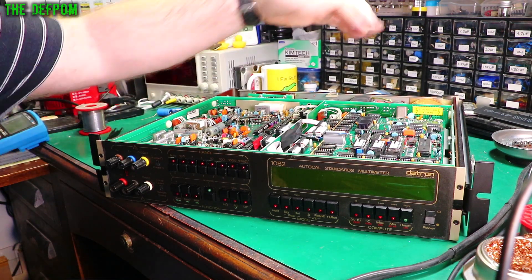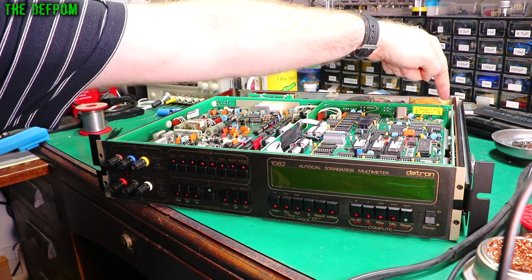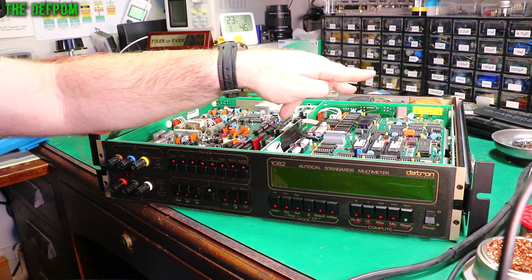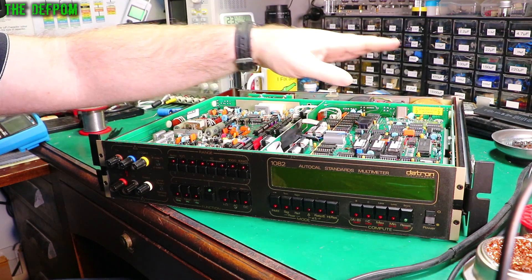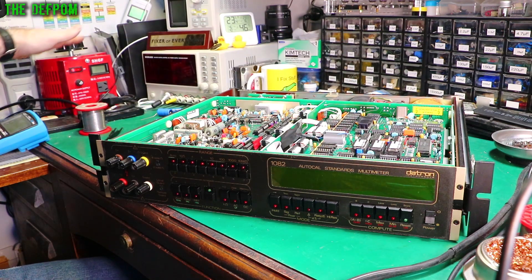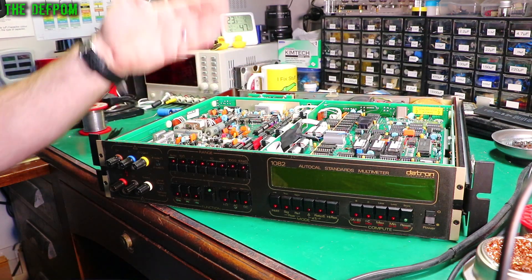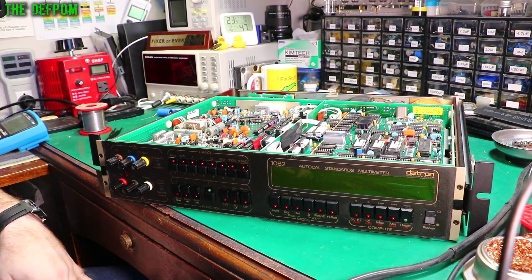Something I've also done: this comes with a setting of 115 volts for the AC supply input. On the bottom edge there's a corner with some jumper links. I've swapped those around — link two and three were in place, I took one out and swung the other around as link one instead, which is the 230-volt setting. Now I can power this up from my local supply without worrying about accidentally feeding 230 volts into a 115-volt piece of gear. That's always a nervous thing for me, so one of the first things I always do is change the voltage setting.